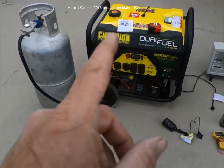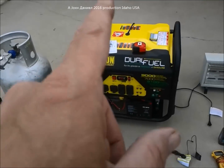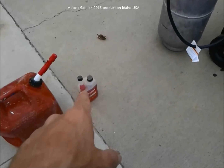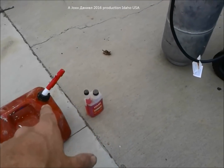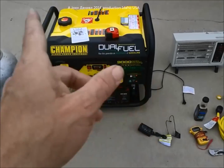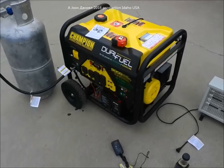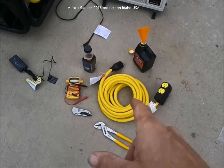About 90% of the people buying one of these generators are going to put gas in it but not add Sta-bil. The other 10% will be running it consistently so they don't need it. But from the first time you fire this generator up and fill its tank, the first thing you need to do is treat it with Sta-bil. I use 91 octane and Sta-bil when I first set a generator up, because I might not burn that tank of fuel for a while. Just filling it, testing it, and parking it doesn't help you. Make sure you protect your gasoline.